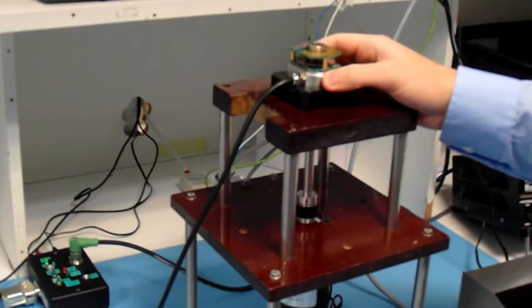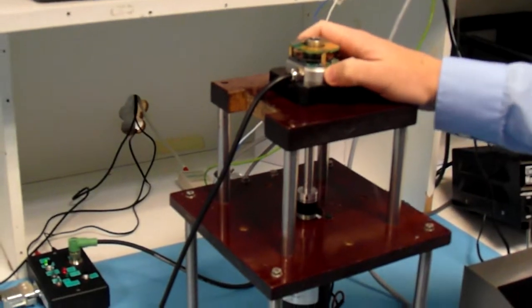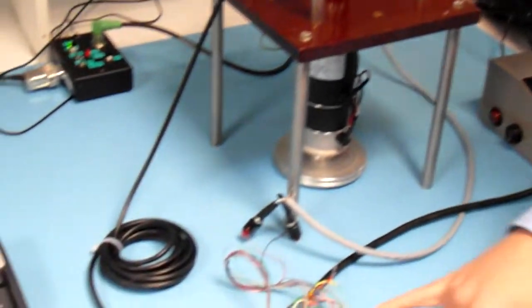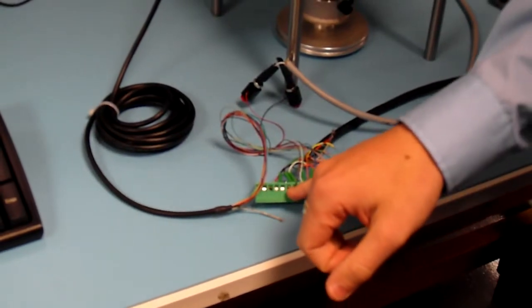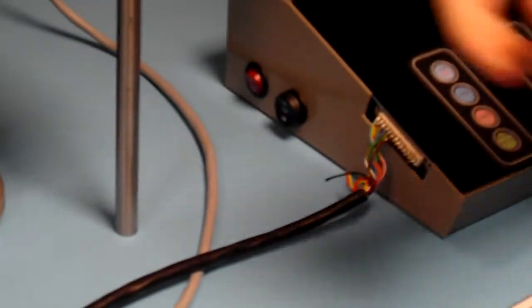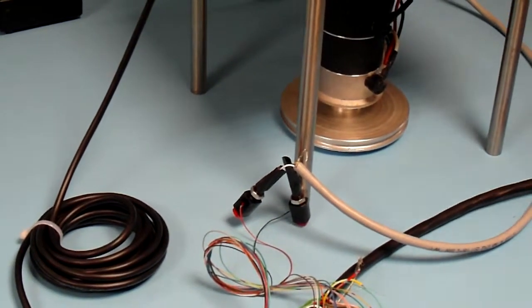Recording. So we've got a 960 encoder, 2048 PPR, 11-bit grey code with a PP output, which is wired up in a terminal block from LSB down to the MSB, which is then plugged into the test box via a 25-pin D connector. The plus volts and the 0 volts are wired up separately to a power supply so it can show whether it's shorted or not.